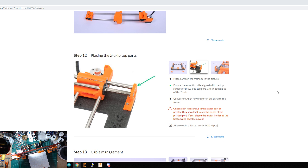is a PCB, right? So the heater coil is basically a copper track laid on the bed, protected just by paint or epoxy, or whatever they put on there, from shorting out. So if the steel plate makes scratches up against it and uncovers the track, it could short it out. I don't know. It's a good thing to think about, I guess. I haven't really given that any thought until you mentioned it.